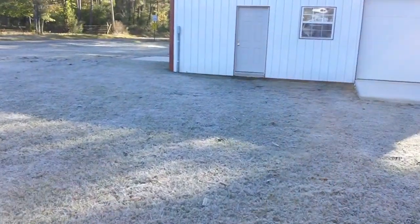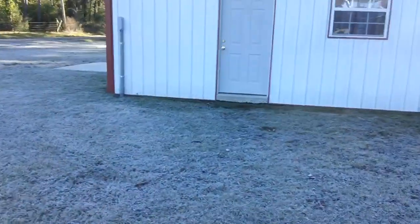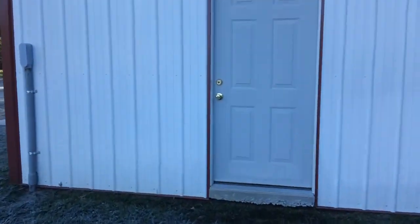I let the heat pump run all night long at 71 degrees. I really want to test this thing out, so let's see if we have any water — I doubt we'll see any until I actually shut it off. Well, there was a lot of drainage — look at the water down here. This is working like a charm! I don't see any water leaking anywhere else along the bottom. It's angled at just the right angle and still nice and solid. We're good to go.